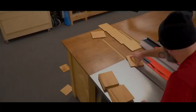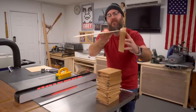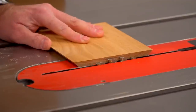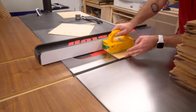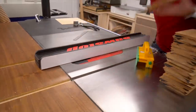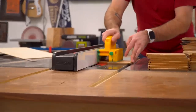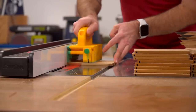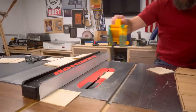Now it's time to cut a groove in the bottom of all these pieces. That groove is going to hold a one-eighth inch piece of plywood. I have my blade set to about half the thickness of the piece and my fence moved over about three-sixteenths of an inch. This is one-eighth inch plywood — I'm going to cut it down to size to fit into the grooves.